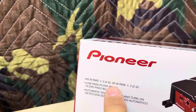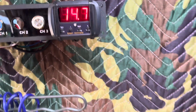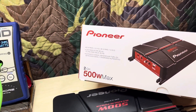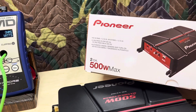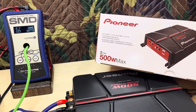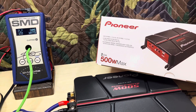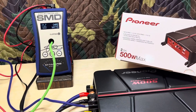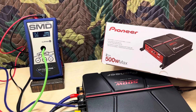The max on that configuration would be 190 watts RMS. The voltage dropped to 14.7 and the current was 19.95 amps. I'm going to say it did its rated power here. I wish they wouldn't put this max stuff on these amps or on the boxes. Stay tuned for my other test where we're going to check it at 4 ohms mono at 1 kHz. And I'm going to do another video where I show the amp a little better — all the controls, the inputs, the ratings, and all of that. Thanks for watching.